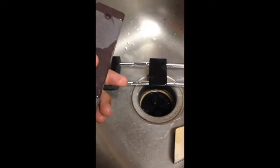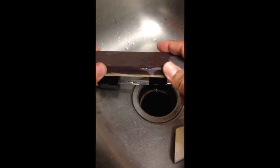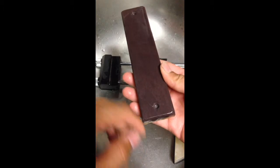Hey, hello YouTubers. Once again I'm honing my straight razor. This is a follow-up to the honing I was doing earlier. I started with a traditional Naniwa to set the bevel, followed by my coticule. Now I'm going to the other side of my coticule — it's a BBW, Belgian Blue side. This is a natural combination stone. Whoever had it last drilled some holes in it, probably to mount it to a stand or box.